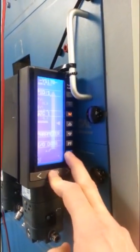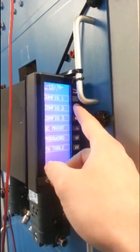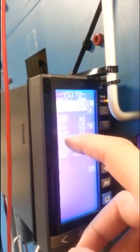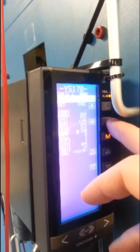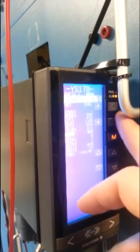I'm going to take the readings that Ryan wrote down in his chart and put them into the Yokogawa controller we have here. I'm going to go to Configure 2, and this is going to be where you're reading. Up here where it says Inhibit, you need to change that to Enable, because Inhibit is where it's locked out right now. The only variables we're worried about in here are SCH1 and SCHL1. We're going to come down to where it says 150 and change that to what our reading was for the high of our flow — we're going to change that to 11.